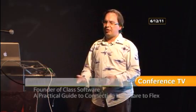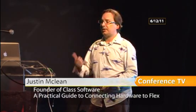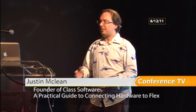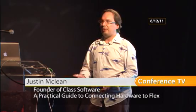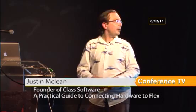So the shields need a little bit of config. This is actually improving in the version 1.0 release of the Arduino platform. The Ethernet library is going to include DHCP and DNS. Currently, it's a bit buggy, so it's better to set your own IP address and your own MAC address. But it's pretty straightforward to do, and I'll show you how to do that in a minute.